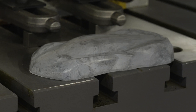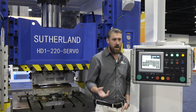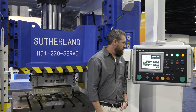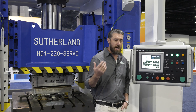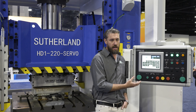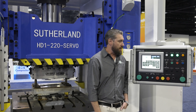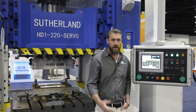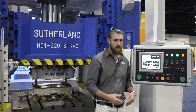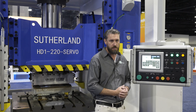They're so versatile — really good for any type of production: fiberglass, carbon fiber, sheet molded compounds. That's what we try to design with the high pressure unit being servo-driven combined with our iPress control — giving the customer an extremely versatile piece of equipment they can use for any product. This press specifically is being used in a research facility where they're changing out tooling a couple of times a day, trying different things, and using the feedback from the control to dial in their tooling and process as good as possible.